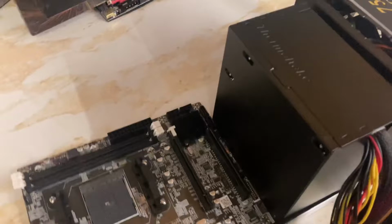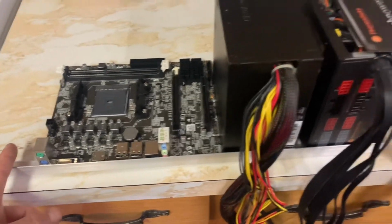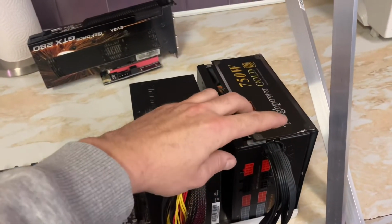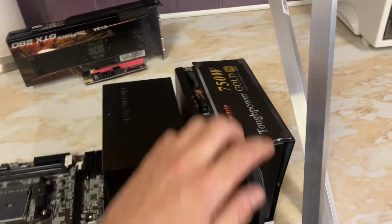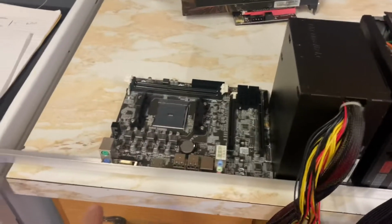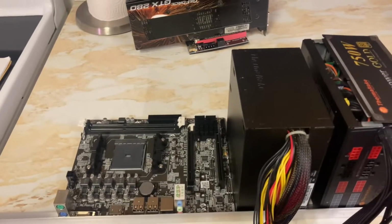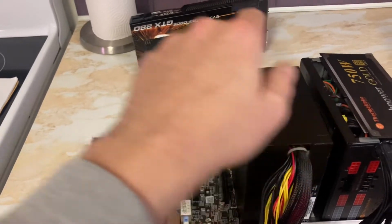So what we'll do is I started off by just taking the aluminum and seeing how long I needed it. So if I make it about 18 inches, it should be about there. And 7 inches high is just high enough above this that if I have to take this out, I can still slide it up and pull it out. So we'll do 18, 18, 7, 7, and then 7, 7, 18, and then once we're done that, we can set the graphics card onto its resting place, and then see exactly where this back piece has to go for the mount.